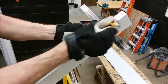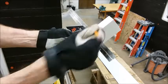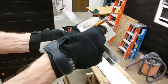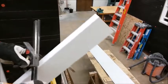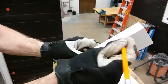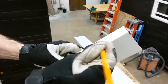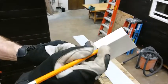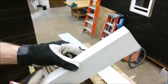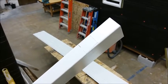Use a square to make your mark all the way across — remember that this is just the bend line. I need to make a tab that sticks out about an inch past the bend line, so that's where I actually need to cut it. Just like all the tabs previously, we're going to taper it a little bit so that it fits in a little bit easier. I'm going to make the taper on both sides, which will also get rid of the hem over here, as it would be a little bit too thick to fit inside the other piece.